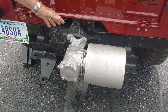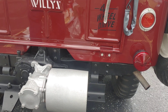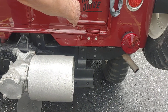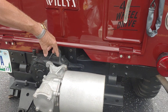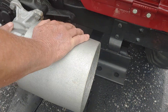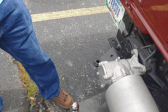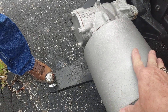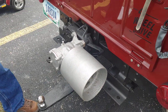Yes. And explain this piece right here. The black part comes right straight from the center of the engine. The transmission comes over here to run the back wheels. But this is a direct drive right out of the engine — you've got a power takeoff shaft here, but this is a belt pulley attached. You could run anything off of this that you could need to run a belt. If you've ever seen a grain mill being run by a tractor, you're going to see a flywheel like this, a belt drive, with a wide leather belt on it. That's what this does.